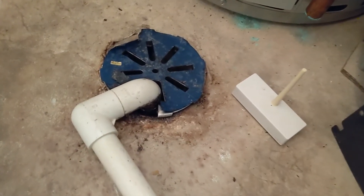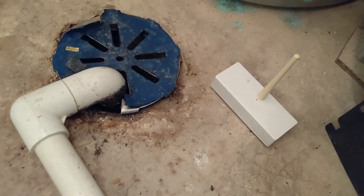I mentioned leak sensors for the sump area. I have them throughout my house in all areas that I anticipate could have a leak: by my sinks, by my toilets, by my water heater, and even by my humidifier — because sometimes the hose isn't seated correctly and it'll start leaking everywhere. These send me a text message since that's a pretty important one. Another thing you can do with a leak sensor is pair it with a home automated water valve on your main connection so that if it senses a leak, it automatically shuts off the water main. That could save you thousands of dollars.